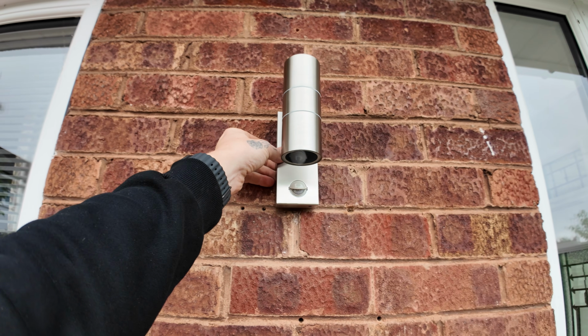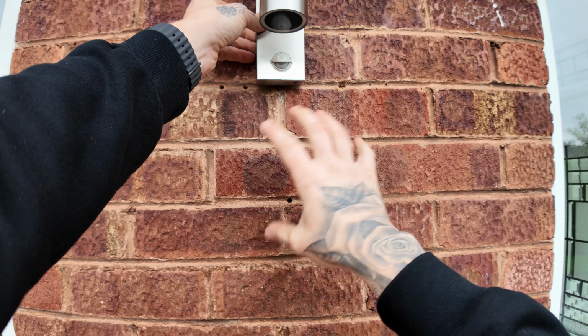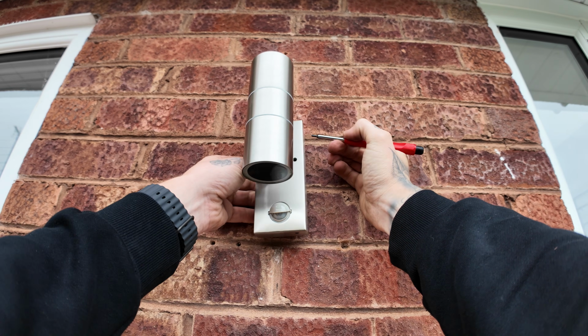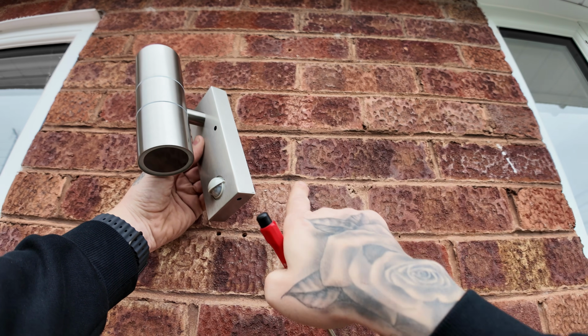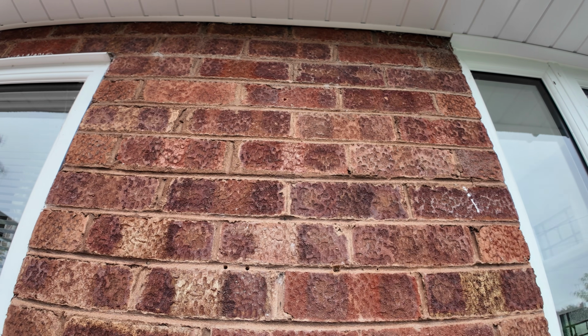That should be fine. It's a good distance away from that, but equally the sign will be in a good stead in there, and we could put the sign in the middle of the wall now rather than to the edge. So what we'll do, we'll attempt to drill. If that's going there, that's going to be our top, that's going to be our bottom. Between this, we're going to use this mortar line to drill up at an angle to get into this cavity, to get a rod up, to go and fish it, so no cables are visible.